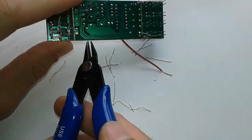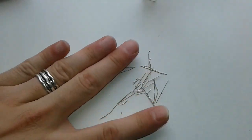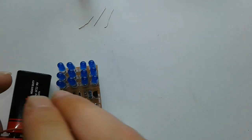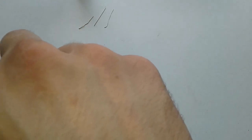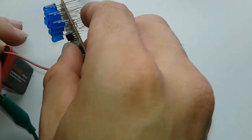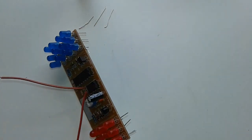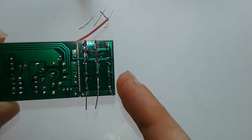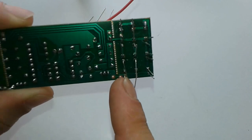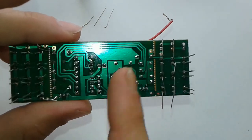Bear with me while I finish cutting these wires. Here's the test — you can see something is making a really bad connection. If we touch this pin on this side, there you go. That's why we're going to save the pins. We have to flip the board, and as you can see in this diagram, we're going to connect the LEDs in series — this one is the positive and this one is the negative — to fix these bad connections causing interruptions.